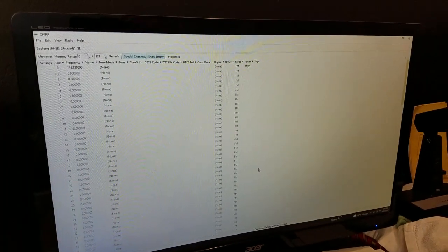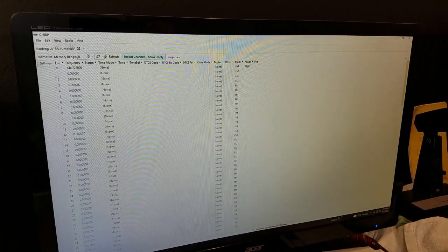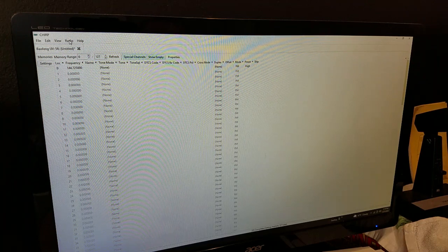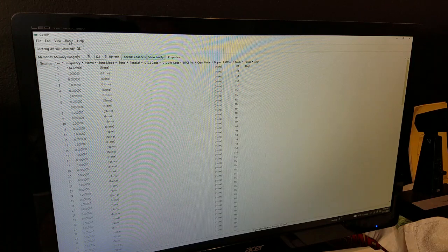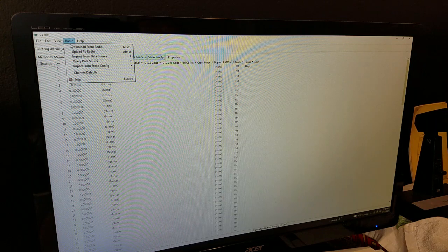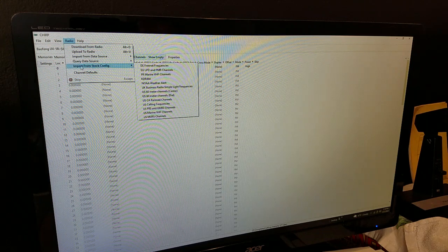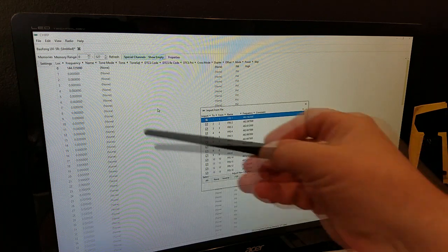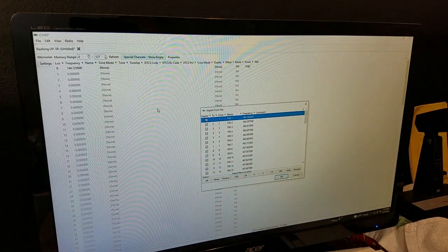When we have confirmation, we'll get the little green light coming on. So what we're going to do in this demonstration is a very simple one. I am going to load up MURS, GMRS, and FRS frequencies. CHIRP makes it really easy — just make sure you get the latest version. I'm going to go to Import from Stock Configuration and do the FRS and GMRS channels first because I want them in order, meaning from the lowest frequency to the top.